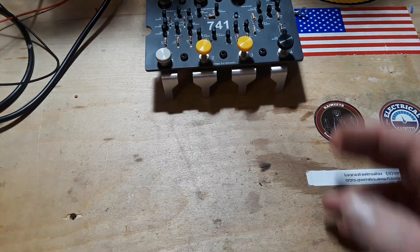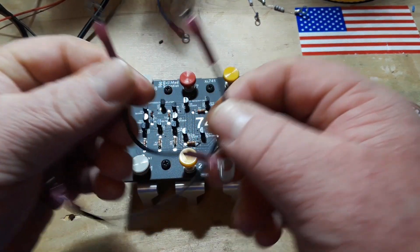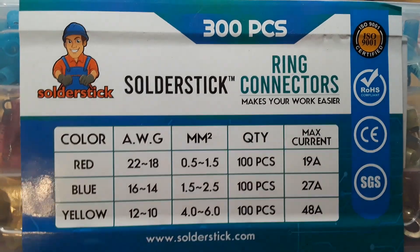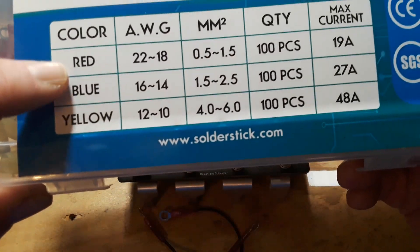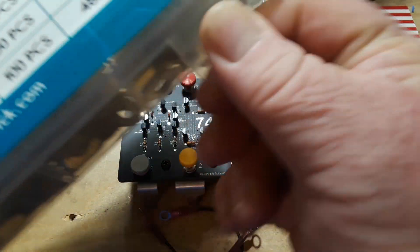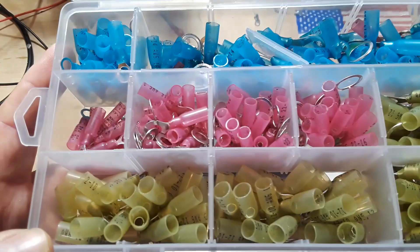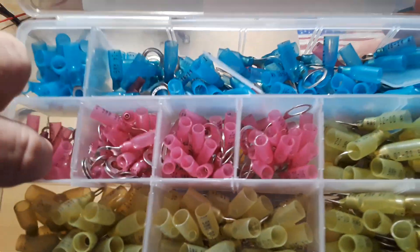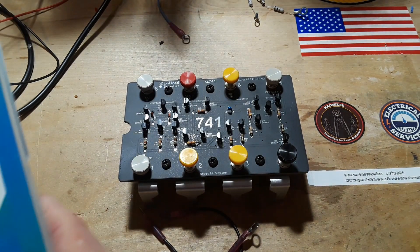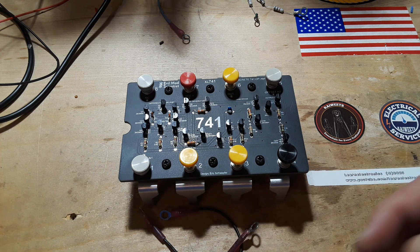Let's take this and bring it down here and put it on this. I made up some wires to use for this with these really nice ring terminals. These ring terminals are from SolderStick — their 300-piece ring connection kit. Three colors: red, blue, and yellow. From 22-gauge down to 10-gauge, from 19-amp to 48-amp. These are super nice kits. I've got a discount for you down below in the description. All you've got to do is crimp on your ring terminal and then shrink the insulator at the end. It's always better to use a ring terminal or fork terminal than to just jam wires in there.